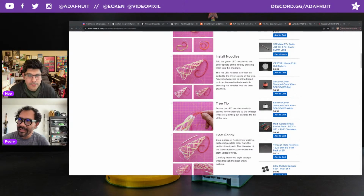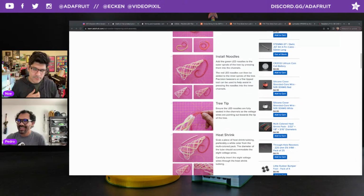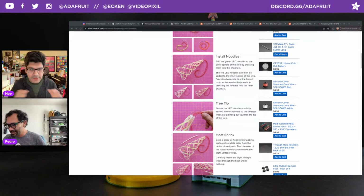And then I just thought of this for the wiring. You should put the headers that it comes with, and then just use female jumper wires to connect each one. So if you get it wrong, oops, let me just pop it out. Yeah, you could do that, and that'd probably be a better idea, because then it's non-destructive connectors.